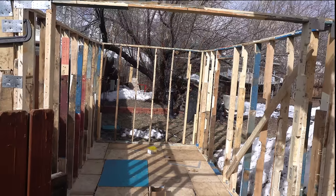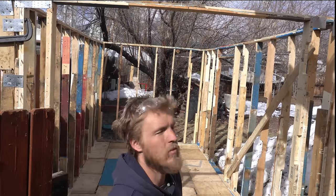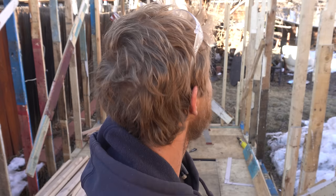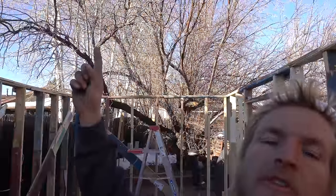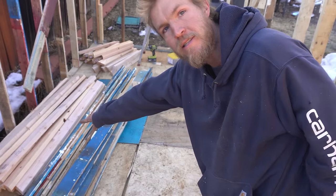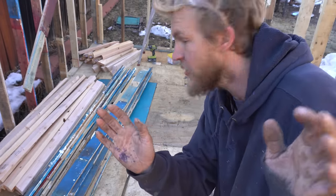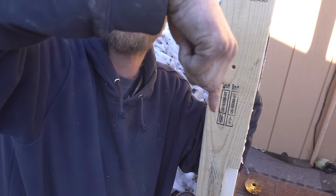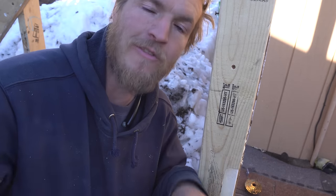Two walls up. The other two walls are gonna go up just the same. Our walls are fully framed up — I started throwing extra pieces onto the sides just to make them a little more rigid, because we're using such a janky material. We've got a double door on the front and a little single door on the side. Time to do the trusses. I broke my own rule a little bit and actually bought some lumber for the trusses, but let's make the roof safe. These janky 2x4s are fine with forces coming down them, but not this way, so I'm gonna use some real lumber for these.